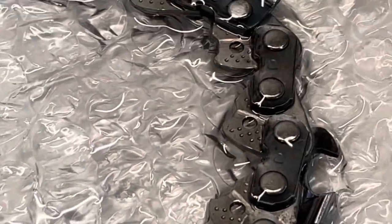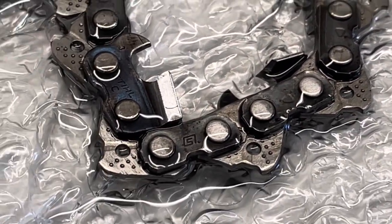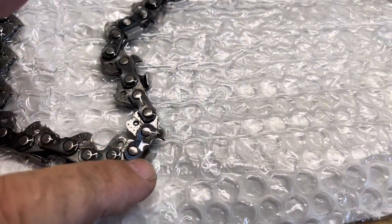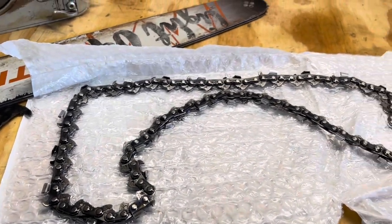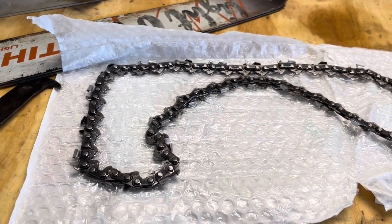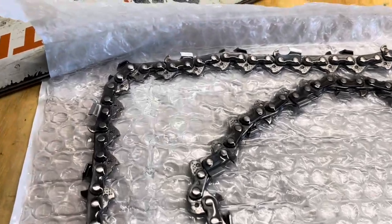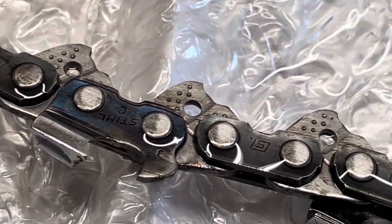Somebody mentioned that maybe I should put it in my tempering oven and heat it up — that might have worked, but I'd be a little concerned about removing the temper. I don't know what temperature these were tempered at; these teeth are hardened, and I don't know at what temperature they'd lose their temper. So I would be leery of that. But the lye works great — two capfuls in about an inch of water. Over the course of a couple hours I shushed it back and forth, reached my fingers in and flipped the chain over. What a difference — I'm completely satisfied that I finally figured out how to get all that stuff off the chain.